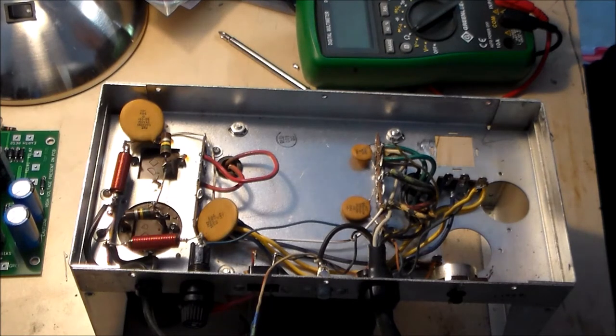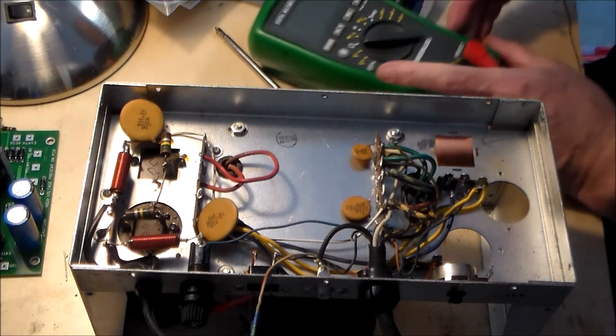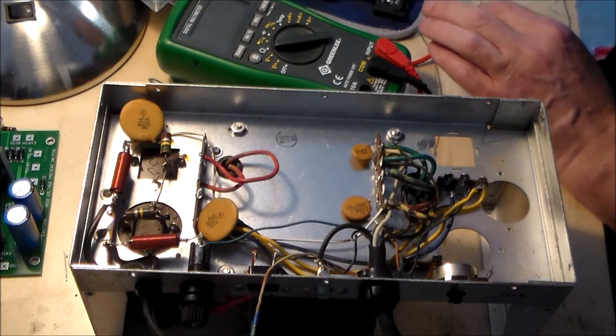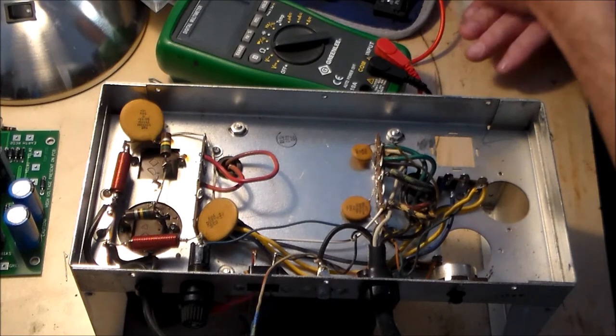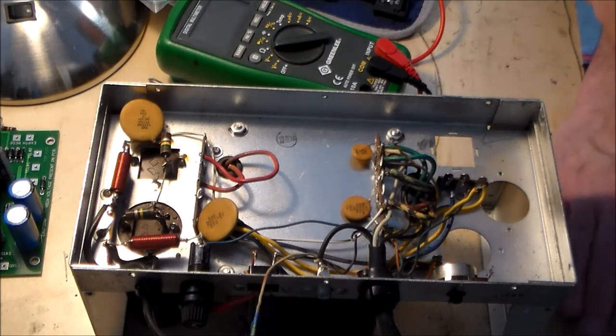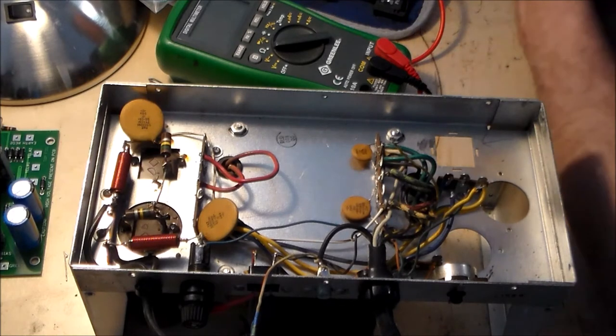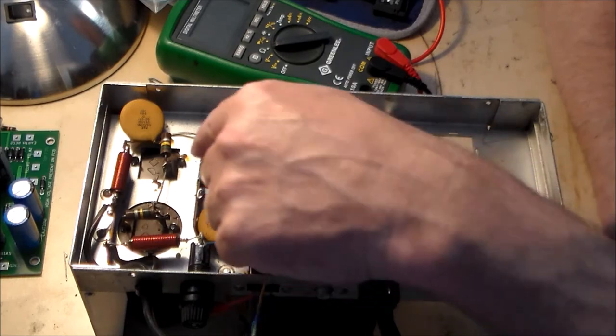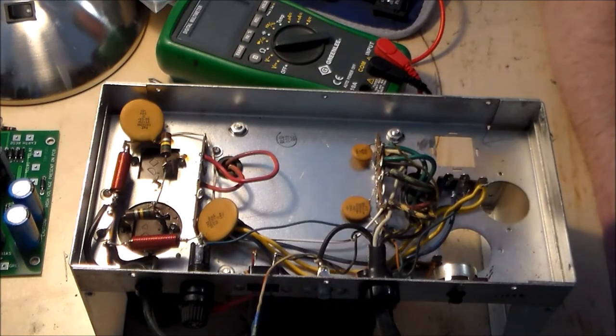Okay, so those are ready for more wires. In this step, you will move the unattached large yellow wire to the empty lug on the solder strip that holds the two large red wires. So this apparently is going over here.